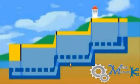And one peculiar thing which everybody has to note, which we cannot see in the Panama Canal lock gate, is the valves over here and the channels. Even though a number of times we have crossed this Panama Canal on ships, these are not visible. So here are various channels, and every lock gate has these channels, separated by valves number 1, 2, 3 and 4. These valves help in transferring the water. Actually, this is done by gravity. No external pump is used for this purpose. So let's see now how this works.